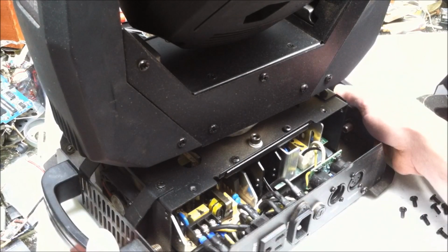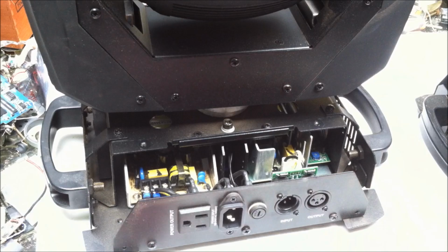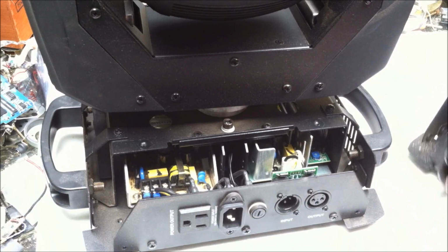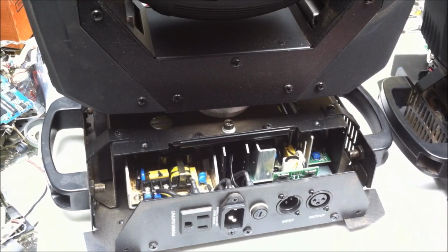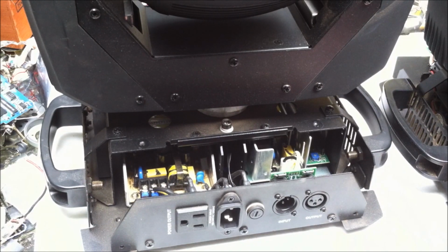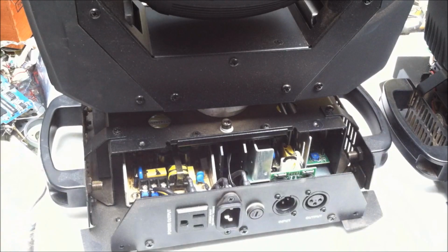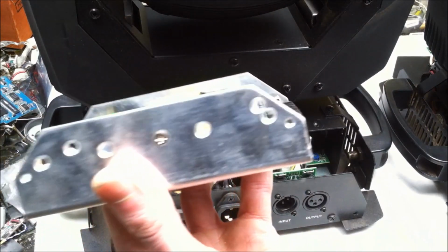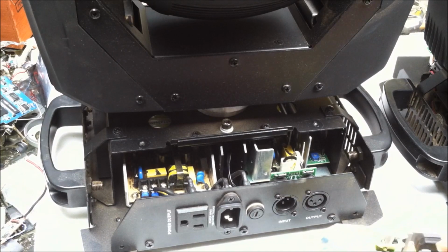Okay, so now we get to compare these two up, and I've already got the power supplies ordered. Now, the power supply was physically damaged from the bottom, and it took out the photocoupler feedback section of the power supply. I tried to repair them, but it just wasn't going too well. I could have replaced every single semiconductor on the power supply, but for $17 and a 1 week wait, I got new ones from the wonderful company of Shenpeng. Wonderful service from that company. A+. Let's move over to the other one.